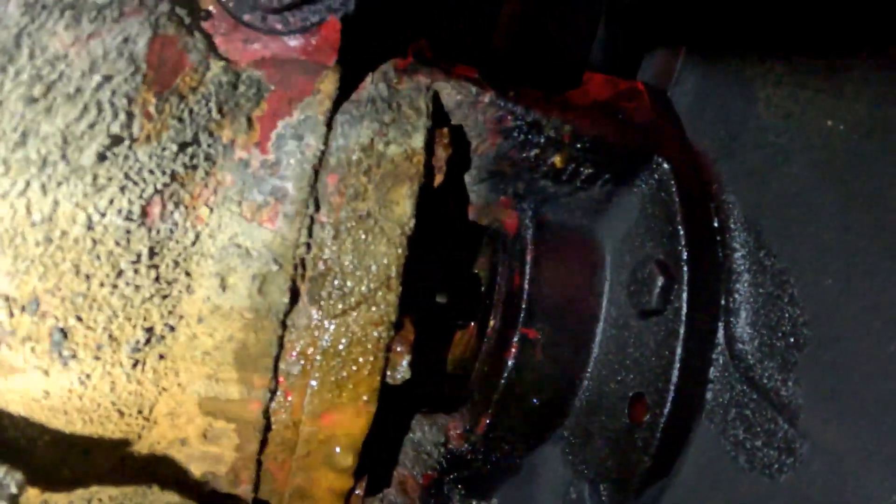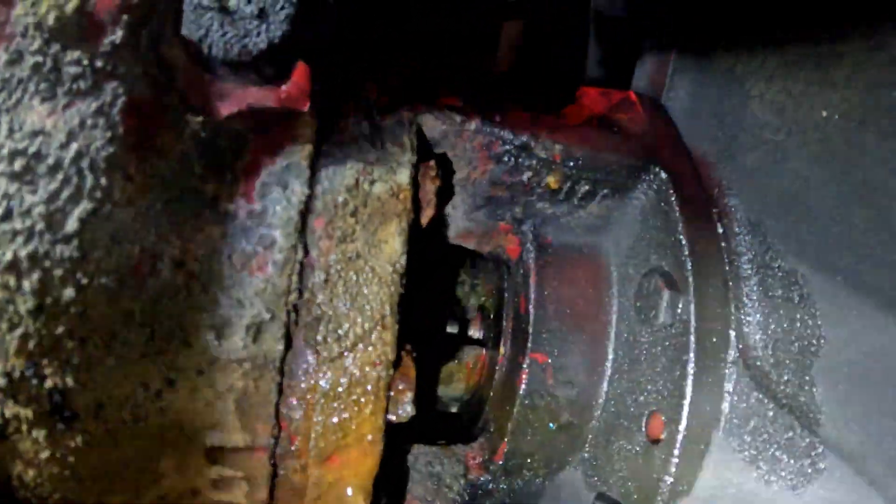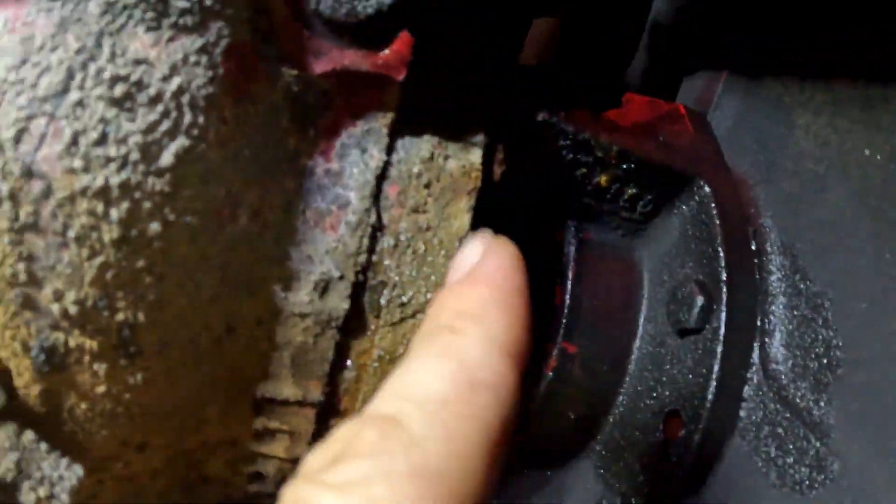We want to rotate that cage upwards, going right, back into the pump. There's a pin — right here is your pin — and there's a little ledge. You rotate that pin around to where the pin going into the side is sitting on the ledge. That's your locking pin and you need to pull it out before you start adjusting.